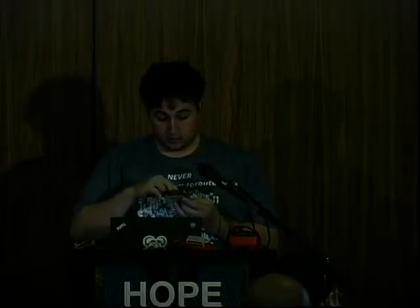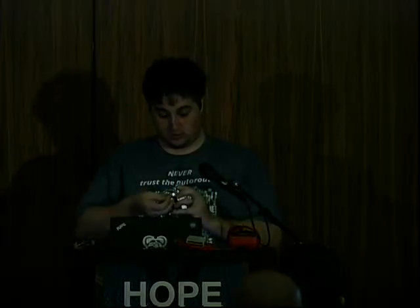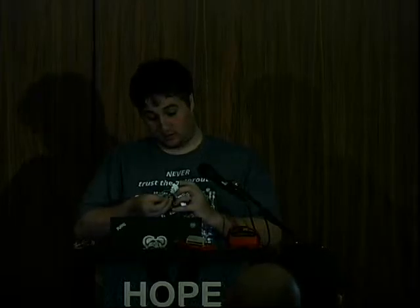And the problem I had with it was when you activate the lock, for a brief moment, all the power leaves the board, leaves the module. I'm sure that their board actually has a capacitor that's big enough to deal with that. I did not plan for that. And so every time my board locks the door, it reboots. And that's a little embarrassing. It's also difficult to get in.